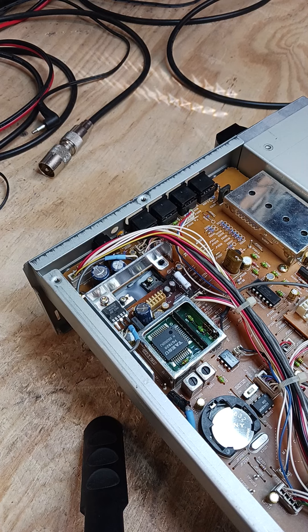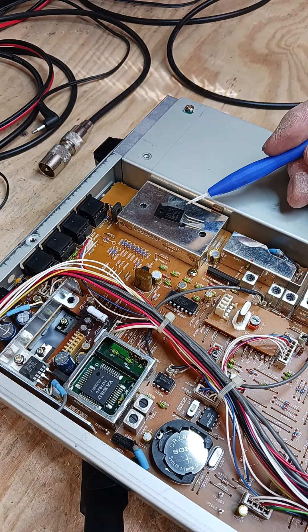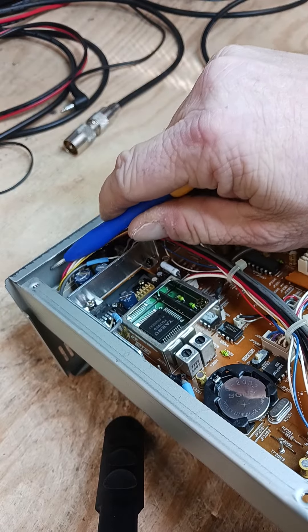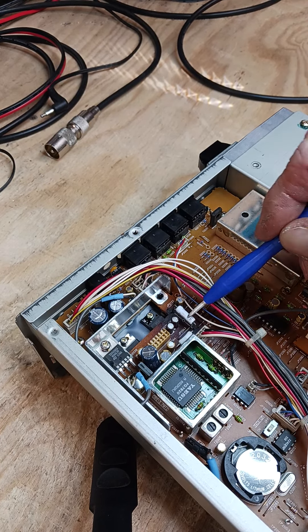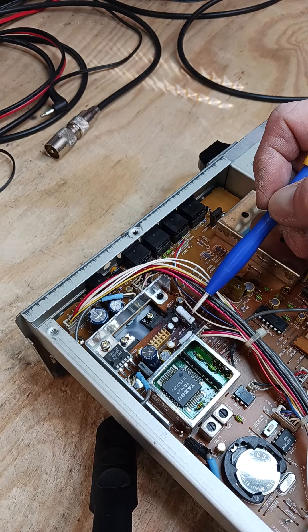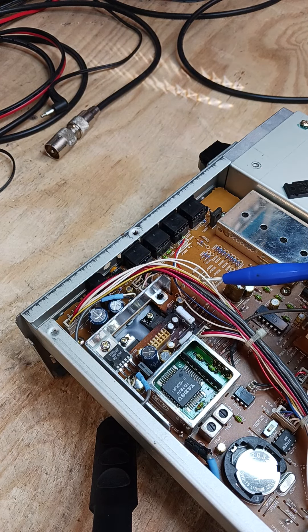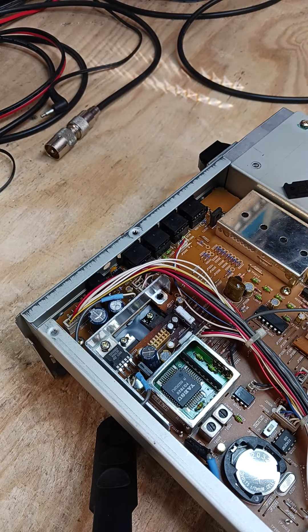What you're going to do is take that power resistor and mount it back here on the backplate. Down to the side there's plenty of room — that's where I mount it. The backplate becomes the heat sink. Right now there's nothing to dissipate the heat, so the board and nearby components take all the abuse. You take it out, run two wires with heat shrink, and fasten the 30-watt power resistor to the side, dressing the wires back to the board with zip ties, nice and neat.